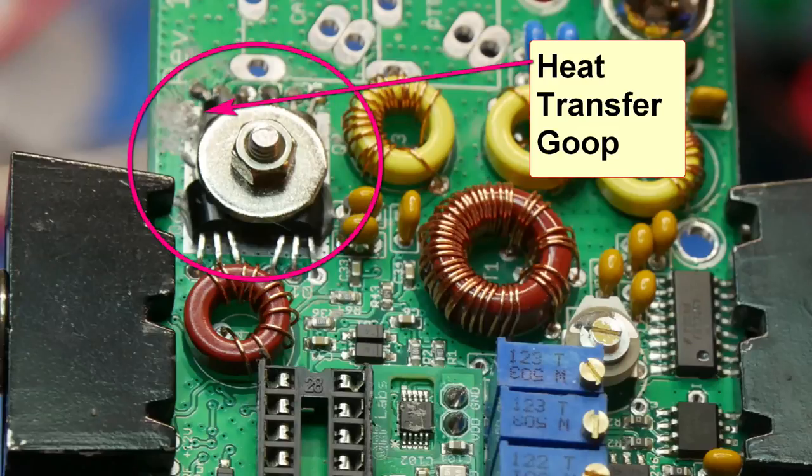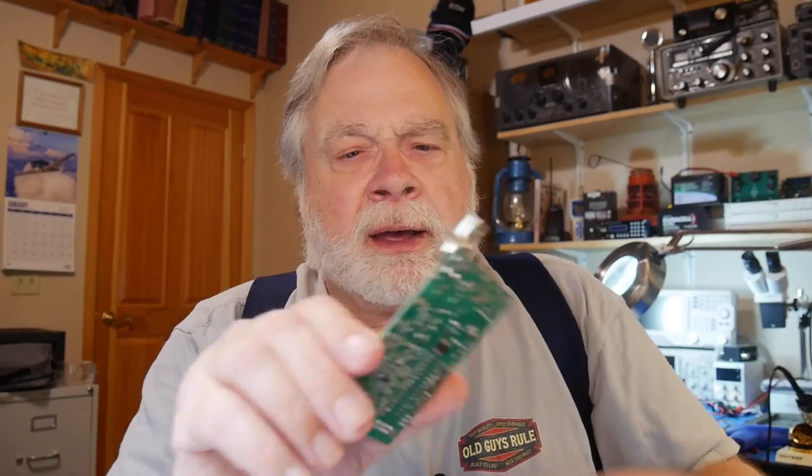The other thing I did was put the transistors in. There's a driver and three finals, and they are under this screw right here. That screw holds all four transistors flat against a metallic surface on the circuit board so the whole board can act as a heat sink. I went one step further and used thermal gel — the heat sink compound used for microprocessors — to enhance heat transfer to the board.